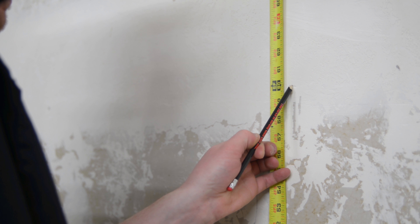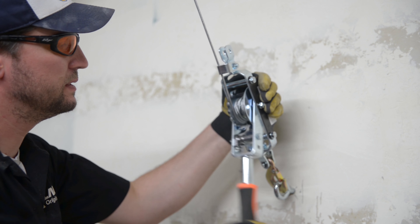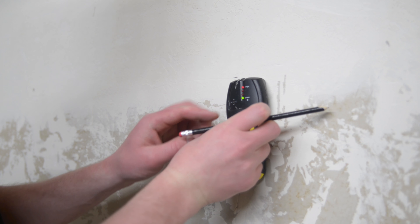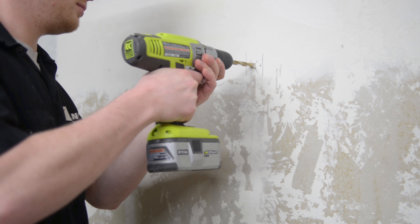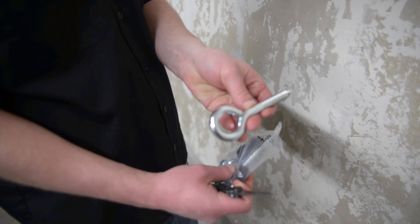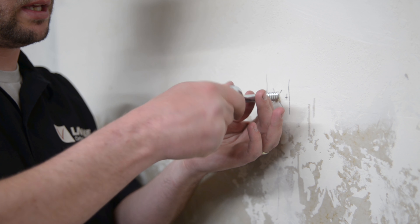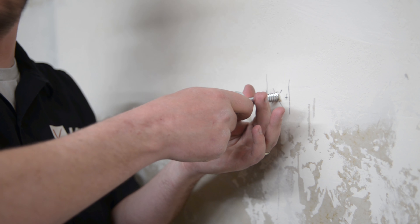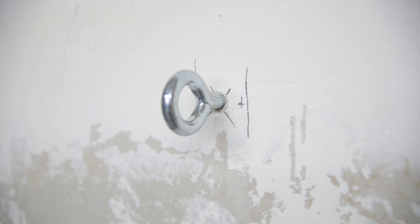You may go up or down from this measurement, but keep in mind you'll need space for the handle to actuate. 60 inches is a good place to start. Find and mark the centers of the wall stud — finding the center is very important. Using the three-eighths inch drill bit, drill a three-inch deep hole in the middle of the wall stud. Open your parts bag and get one of the two eye lag bolts. Start by hand until turning becomes hard, then use a large screwdriver or equivalent to screw the lag bolt in until it is almost at the base of the eye.